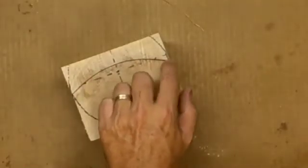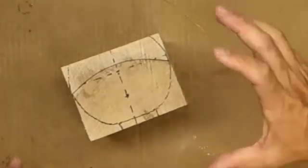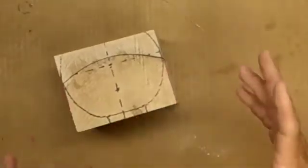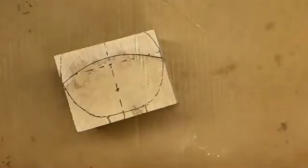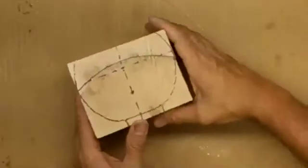And maybe you even end up high over here. And the worst case is the wave's not 100% balanced properly. But if you've gotten everything else right, you've squared the wood up, you've squared the fence up, the tabletop of the bandsaw, and everything's good to go, then it should still work. You'll notice I cut off that pencil line just about perfectly. So that should be a really nice balanced wave.